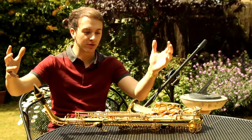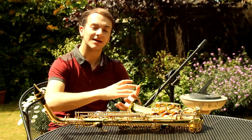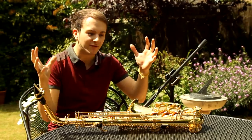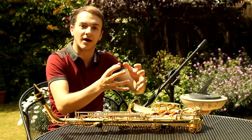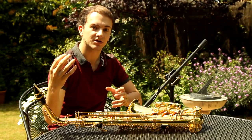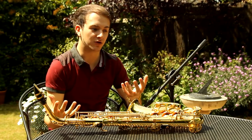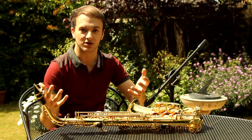Another thing you'll find in T-Line boxes is acoustic wadding stuffed inside the line. This effectively slows down the speed of sound inside the box, which slows down the rate at which the air sets up a standing wave. So if you want 30 Hz but the box can't fit your application, you make the T-Line box a little wider, then stuff the inside progressively with different thicknesses of acoustic wadding — thickest at the end — compressing the 30 Hz wavelength so you still get 30 Hz but in a smaller box, with a softer, less resonant, more punchy sound.